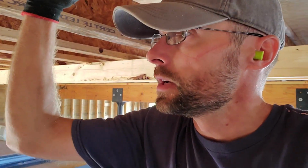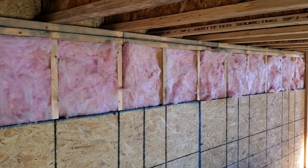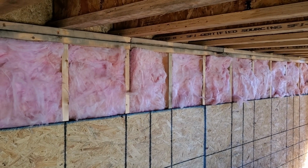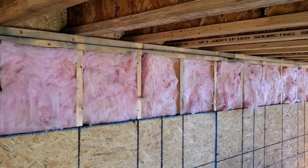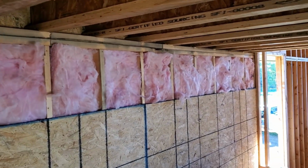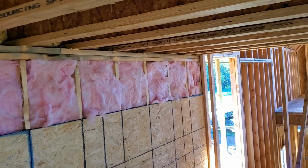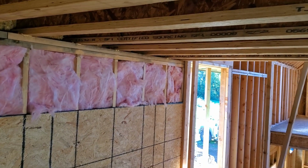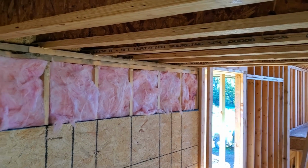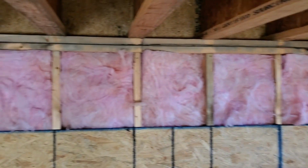Quick. What I'm looking at now is trying to decide if I should finish up this top row or not. It's just over 19 inches, and as most of us know, you can divide 8 feet up into 19.2, something like that. So I can take an 8-footer and cut it down into an exact amount of pieces, and we'll have little waste to fill in this top part.